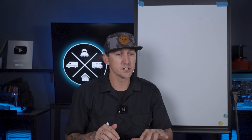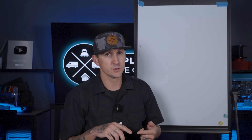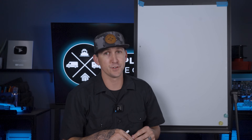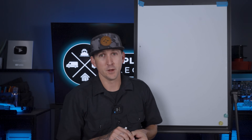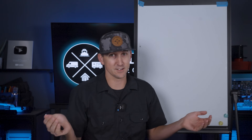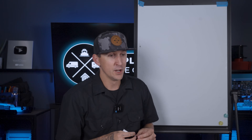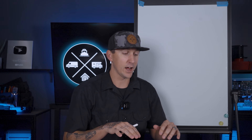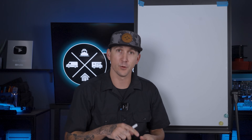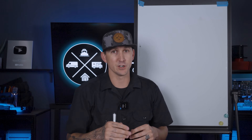Before we dive into the math of how to size fuses, it's important to understand that a lot of manufacturers of chargers, components, devices, etc. may make their own fuse size recommendations, and most of the time it's a really good idea to just follow those recommendations unless you have a really good reason not to. A good reason to not follow them is if the fuse size recommendation doesn't exist, or doesn't exist in the type of fuse you're going to be installing. For example, I saw a charge controller the other day that recommended a 33 amp fuse, and you're going to have a really hard time finding a 33 amp fuse. We're going to dive into the math and find out how we can determine a range of fuse sizes that will be appropriate for the wire size we're using, and you can use that in conjunction with any manufacturer's recommendations.